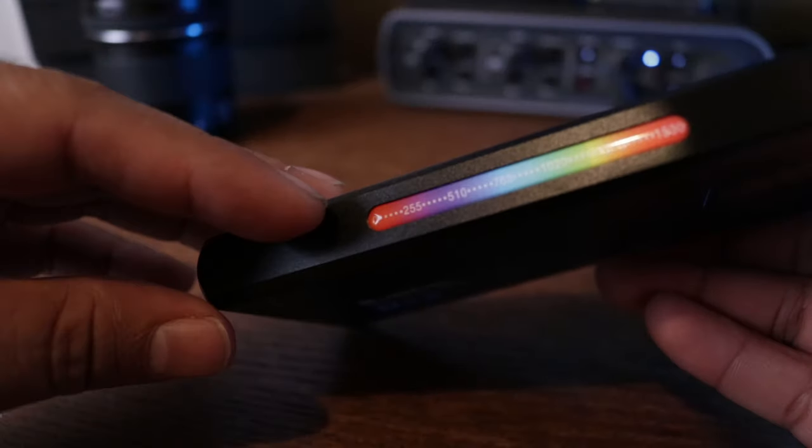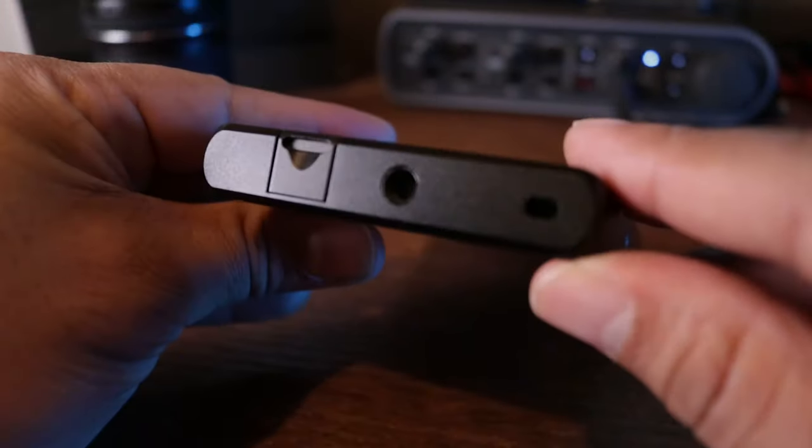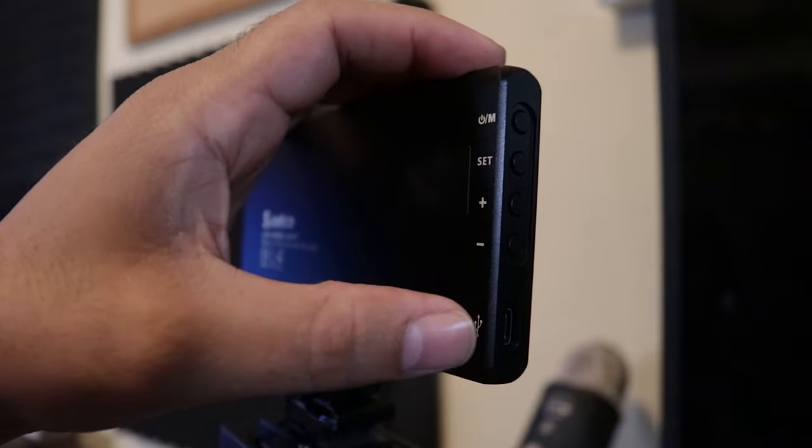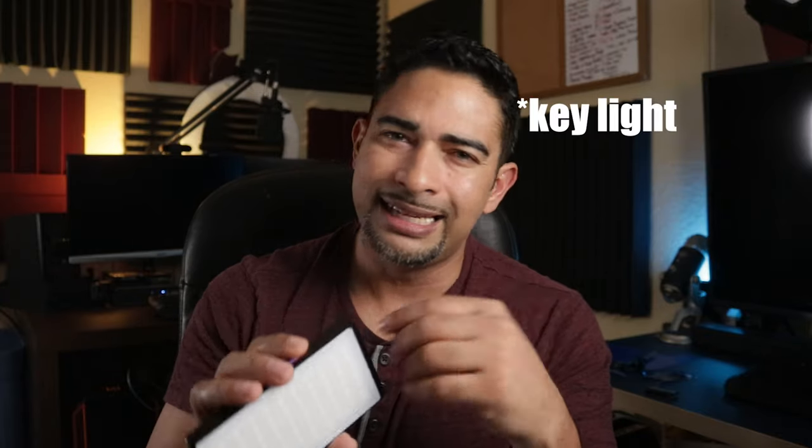You've got a little cheat sheet for your color chart if you want to dial into a certain hue — you've got your number series you can dial in from the back. You've got two screw mounts on this light, one on the bottom and one on the side, so you can place it on top of your camera or on a tripod. On the light itself you have a power button, a mode button, a set button, plus and minus buttons, and your USB port. I would use this light for adding additional accents, fill lights, and to take my lighting to the next level with dynamic background lighting in my commercial work and YouTube videos.